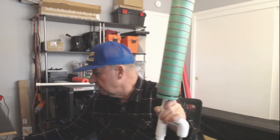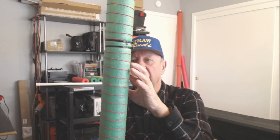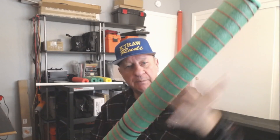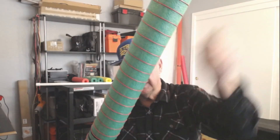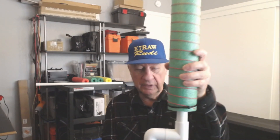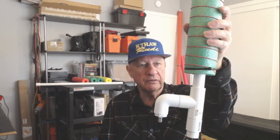I'll put the materials and instructions in the description below — it should be pretty straightforward to build one. I put a three-quarter inch cap on the top to keep the rain out. If you're going to leave it in the sun, the pool noodle won't last that long — UV gets to it after a while. There are places where you can buy PVC heat-shrink tubing, both slip-on tubing and a cap. Slip the tubing on, slip the cap over the tubing, and heat-shrink it all with a heat gun. Now you have a completely sealed weatherproof design, keeping your connector out of the weather and rain.